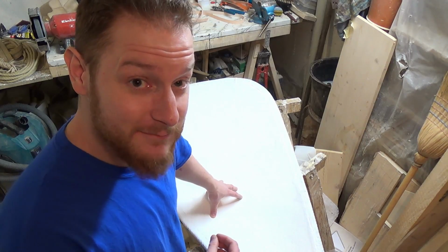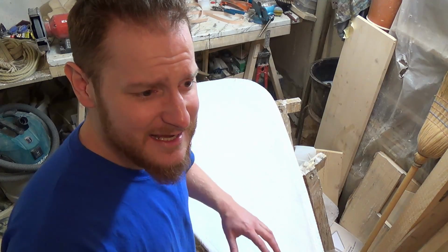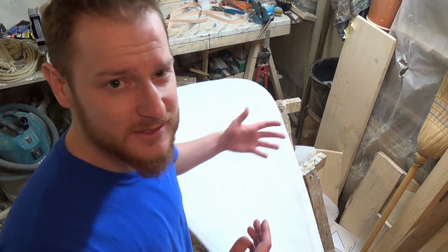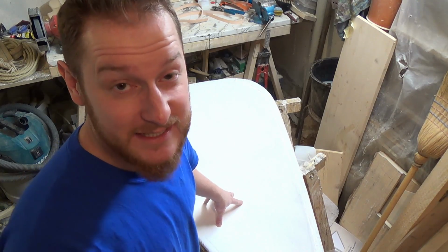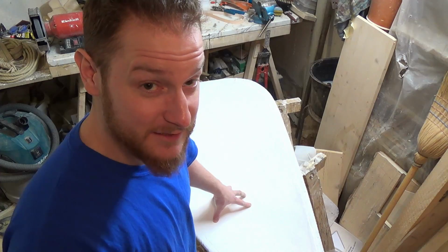The reason why I already applied the paint of the back and the varnish is because otherwise I would have to paint around the straps, and this usually looks bad and it's a bit more difficult, and you've got blank spots beneath the straps directly which water could penetrate and so on, so that's the better method.